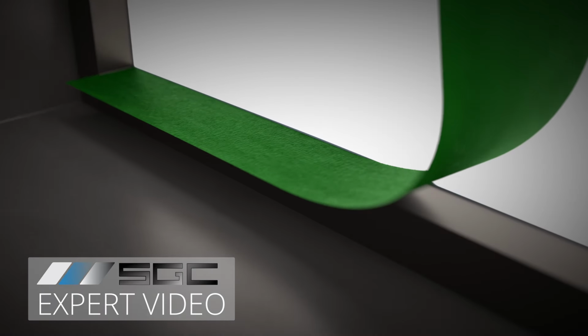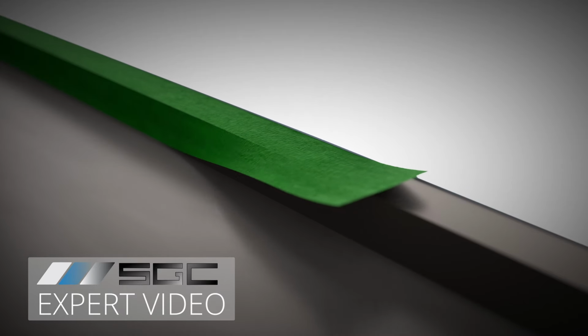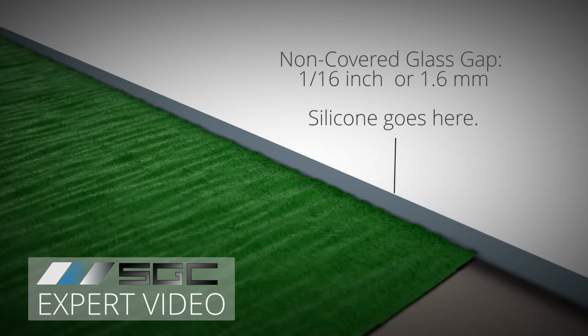Start by applying painter's tape to both edges of the film and the frame. Leave a gap of about 1/16 inch or 1.6 millimeters between the tape lines.